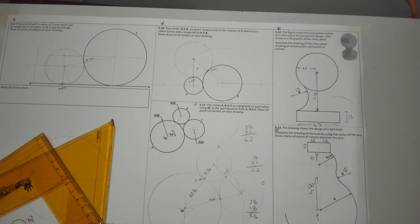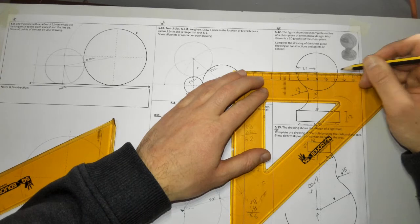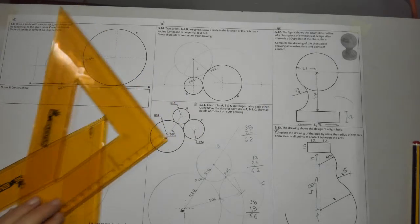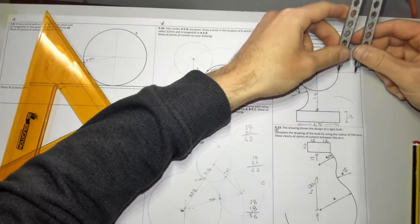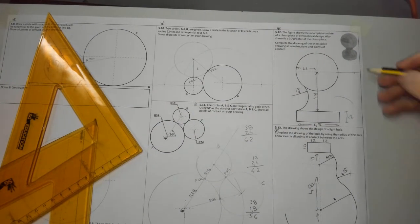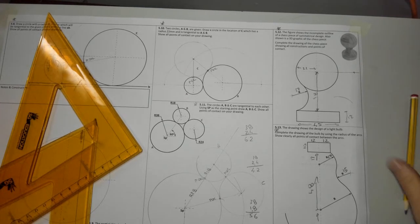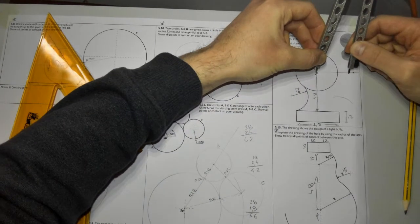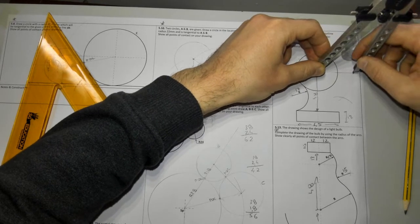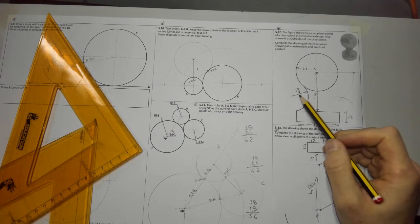Then what you need to do is take a line out from the centre of the circle here and add on that radius r to it. So all I'll do is put my compass here, dot that. That's my distance there. That's r distance away from that there, or 17 if you don't have the book with you. Now I get my centre up here, stretch out my compass to that point, and where the two cross is the centre point of that circle there.